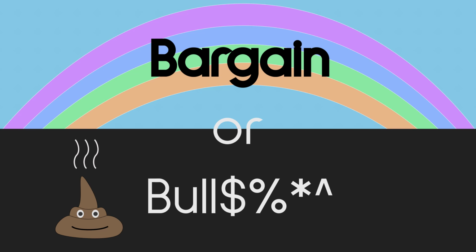And they aren't really clear on their statistics as to how they got to their measurement. If the THD measured was at the lowest point powered or if it was at max power, it's very unclear. And that's kind of the problem with how a lot of manufacturers are displaying their data. There will be a follow-up episode to this, where a company rated their product, and it wasn't perfect, but at least their power rating was on point. The harmonic distortion was measured a little differently again.